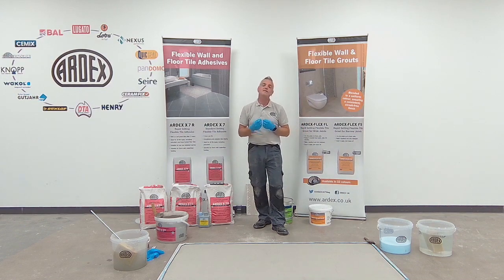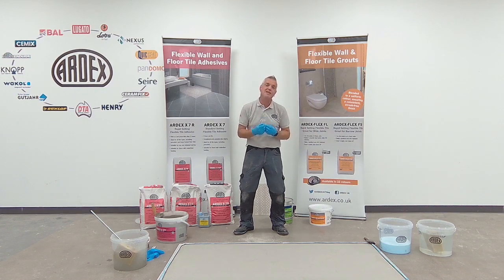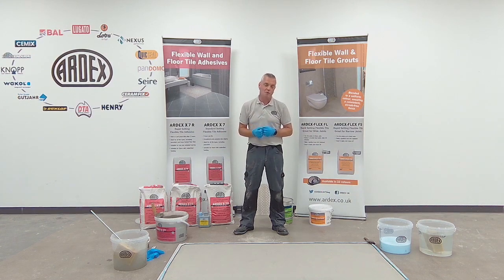Ultimately, and this applies not just to ARDEX products, but to all products out there, cementitious products, because they're a chemical cure, heat up as they start to set and get that hydration. If the temperature rises too quickly, the product will tend to flash set, but the adhesion will not achieve its full performance. Therefore, you can have issues with tiles debonding. You can also get shrinkage and cracking, and you'll see this more so when using products like levelling compounds, but ultimately, the product could fail.